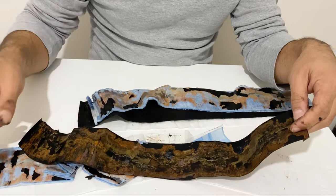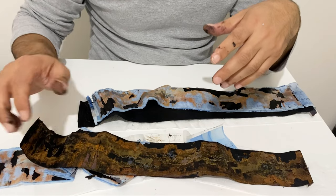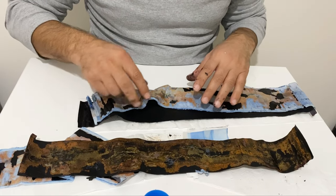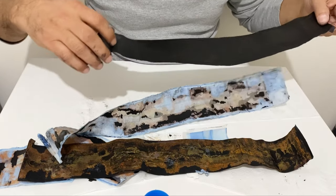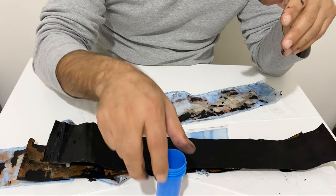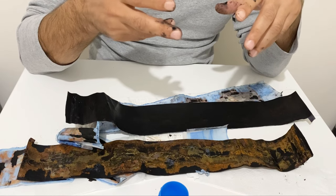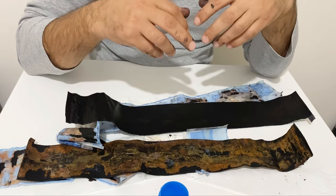You can use your homemade supercapacitor for about 1,000 charge-discharge cycles, which is roughly one to two years — pretty good for a homemade device. After that the supercapacitor will begin to die as you can see inside. To summarize: get two pieces of copper foil or aluminum foil as current collectors, paste on the active material, use two pieces of separator, roll it up, seal it in a plastic container or tube, and your supercapacitor is ready. I hope you enjoyed the video and learned something about supercapacitors and batteries. Please like and subscribe — take care, see you in the next video!